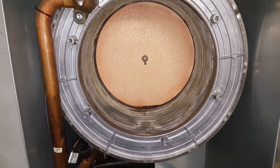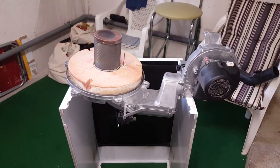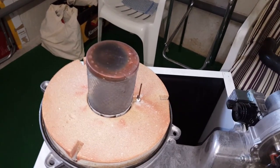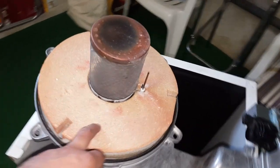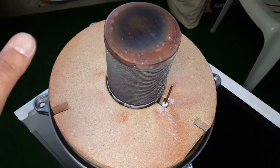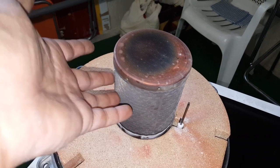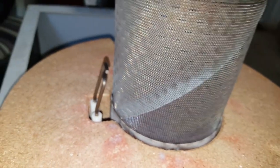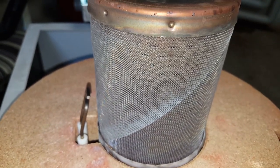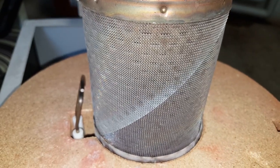Now that the boiler body is done, let's look at the burner head. We're using the boiler casing as a small work table. There are two — actually three — things to check on the burner head: first, that the refractory ceramic (chamotte) is intact, not crumbling, and doesn't need replacing. Second, inspect the burner matrix all the way around — if you see any cracks, holes, or damage, it must be replaced immediately. No room for compromise: if it's damaged, combustion won't proceed correctly and it can cause serious problems.